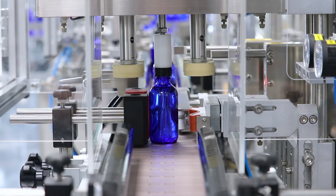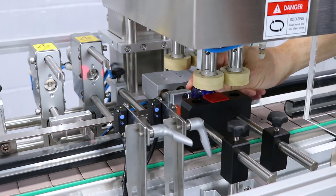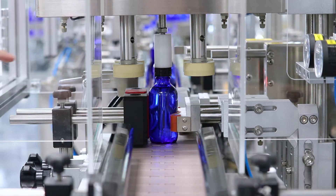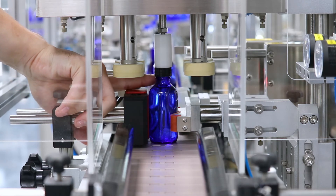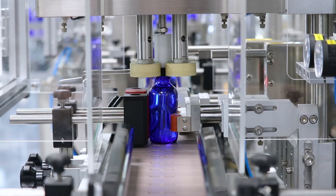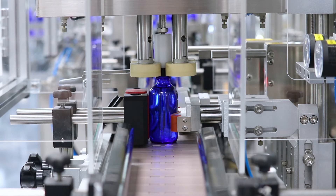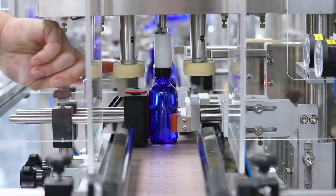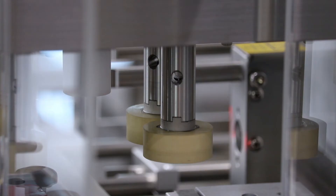Press the white press cap down button and clamp the bottle forward — it should all be held in place nice and snug. Make sure your four rollers are below the bottom lip of the cap. When you press capping forward, that brings the four rollers forward and below the lip of the cap. The four rollers will spin and tighten the cap onto your product. To adjust the wheel motor torque setting, which affects the four rollers, you can increase or decrease the speed to change the tightness of the cap.